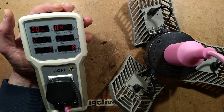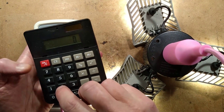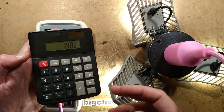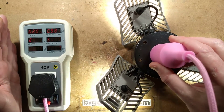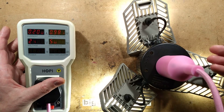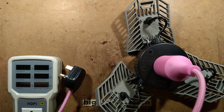The power has dropped down to just 0.7 watts but the power factor in this instance is 0.4. At 6 milliamps, 247 volts — 247 volts times 0.006 amps, even if you're charged reactive power it's only going to be 1.5 watts. This is good. I'm guessing from the fact there's a relay clicking inside that they've chosen the option of killing power to all the modules inside. Some of the other Doppler lamps just shunt the power supply to turn it off. Note this 0.981 power factor — which is just awesome, a spectacularly good power factor.